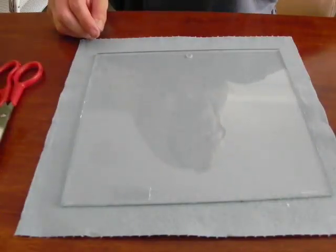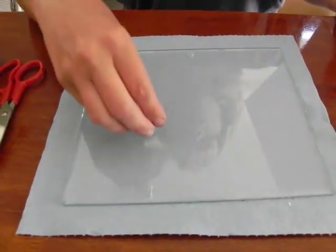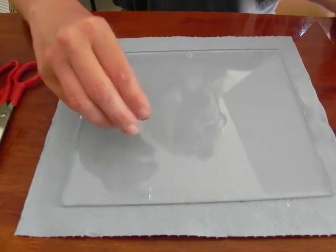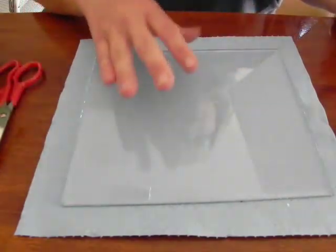One of the best ways to work and engrave on glass is to use copy paper. The reason for this is that we don't want the heat of the laser concentrated in one area, as it may crack the glass. So using something like the masking material seen in other lessons, the liquid mask, or the laser tape, helps to distribute the heat. If you're not using a mask, the next best and cheapest way is just to use copy paper.